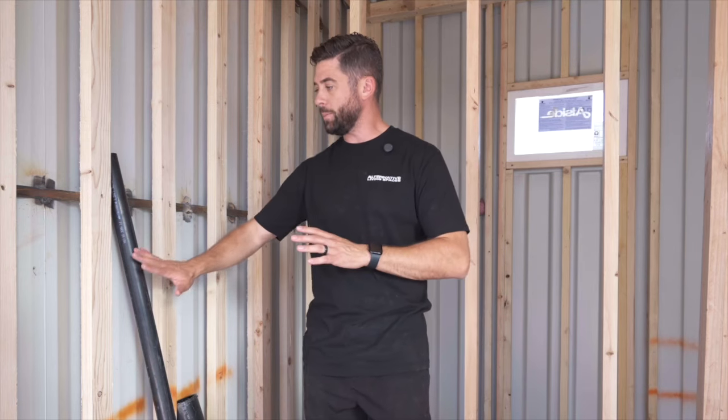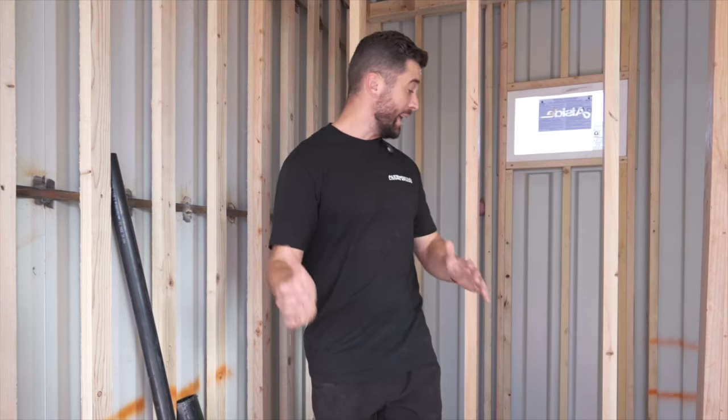So essentially, all of your main fixtures are gonna have drain lines, right? We went over the different sizes here. This is the type that you can use. Now, how you run those through your container floors and out of your container can vary by the type of foundation that you're doing. For example, if you have a slab foundation, that means all of your plumbing is gonna have to exit out the back of the container because you aren't gonna be able to access underneath your container to make any connections after it's installed.